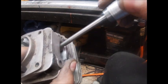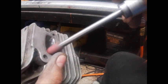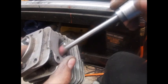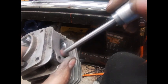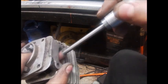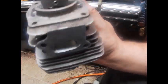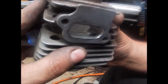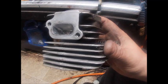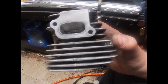Good stuff — you want to take your time on it. We're in real time right now, but I'm not going to take this one as far as I would on somebody's work saw. You'll want to make sure this corner is really good — carbon locks will get in there. And don't be surprised if some of your paper chips away or flies off, it's all part of it. Nine out of ten people would just be tickled to death with that finish — it is smooth as glass. The faster you run that paper and the lighter the pressure you use, the better the end result.